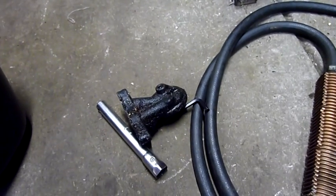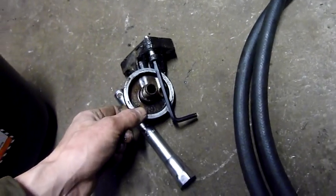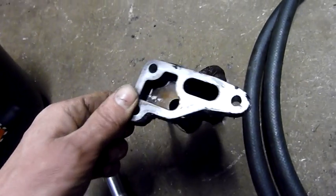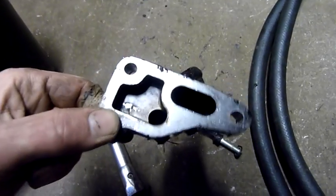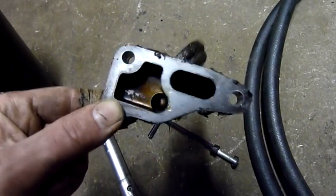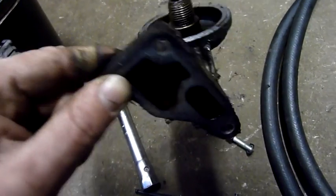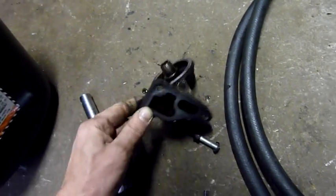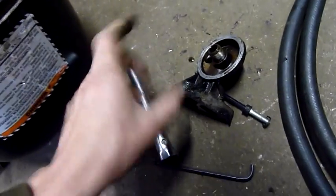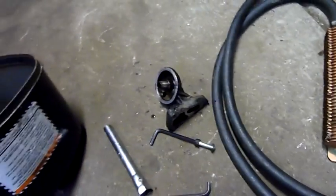It's good having scrap stuff lying around. While it might look like something coming out of Loch Ness, that is exactly what I need. It needs a good clean-up but that's exactly what I need. I'm probably going to have to fabricate a plate to go over this flange here because I can't just drill and tap a thread in that, particularly the central oil gallery. That's the discharge side of the filter, inlet's on there. I could probably cut the flange off and tap into that one, but that one there's ovalized, so I'm going to have to take a bit of 12mm thick alloy plate and just make my own little cover with BSP threads tapped into it.